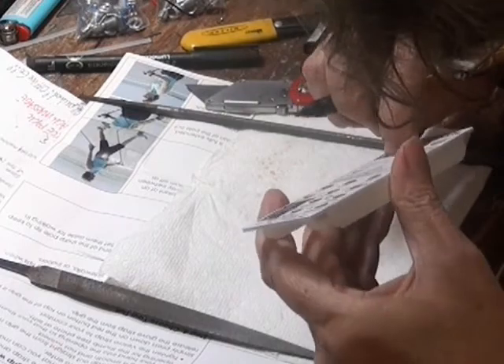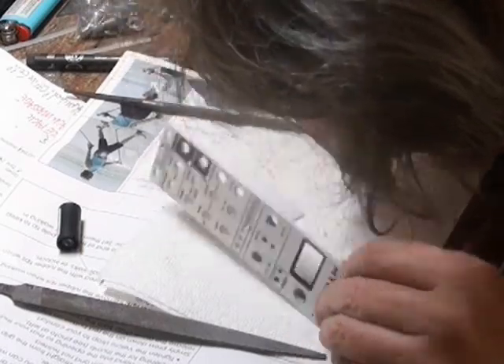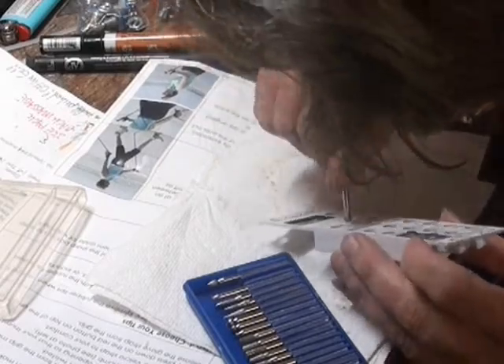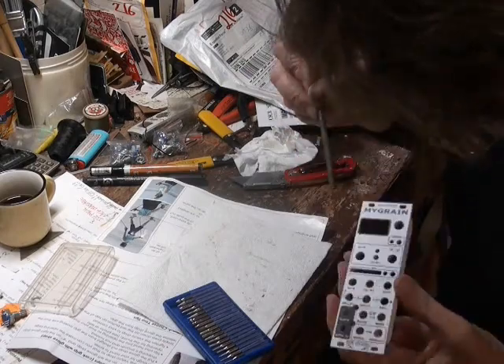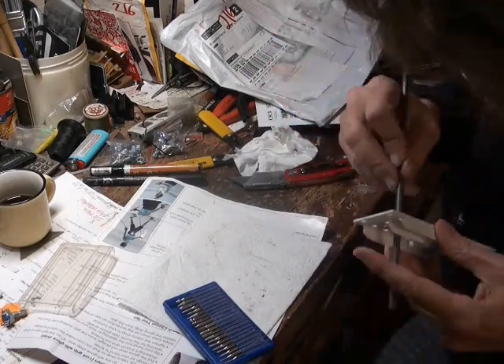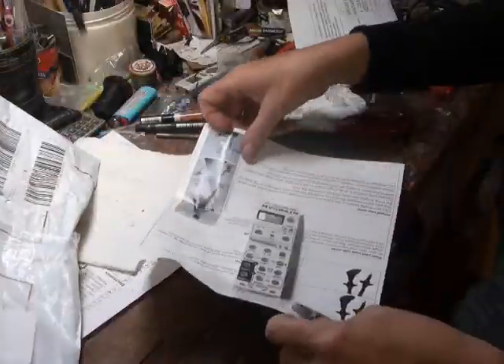The window's inside edges must be painted with acrylic black paint to make the frame continuous into the opening. I like to spin a diamond cone bit in the LED holes to remove any uneven edges because they will show. Once everything is filed to perfection, a final spray of clear coat will finish it and reinforce all the edges.